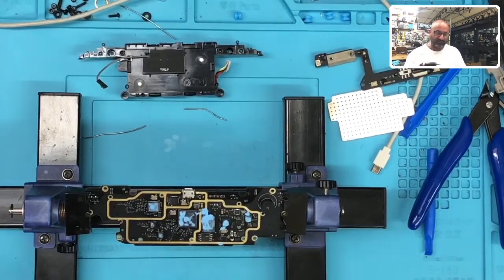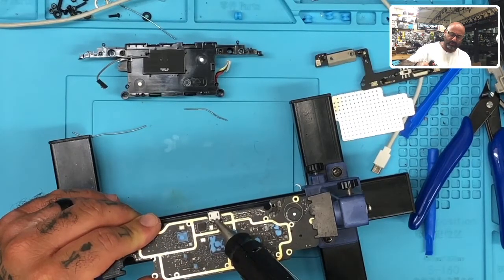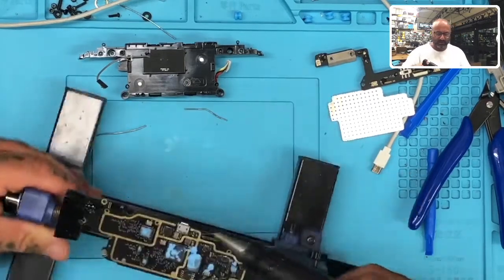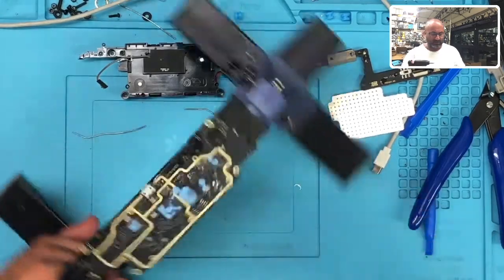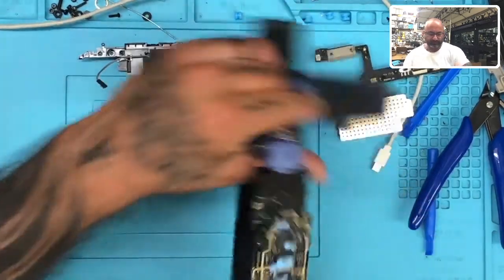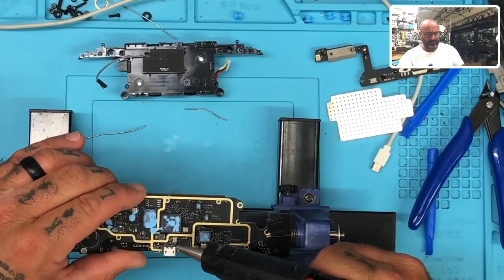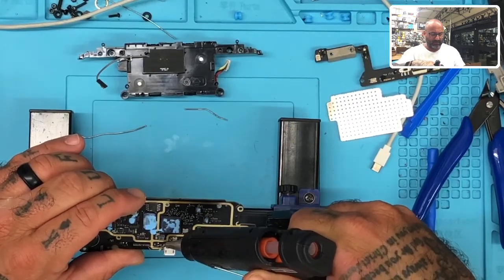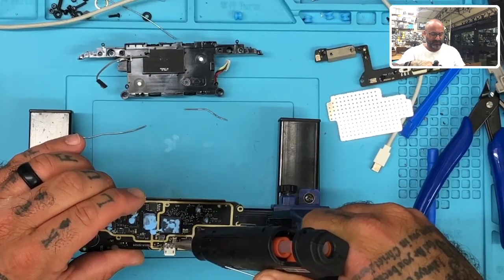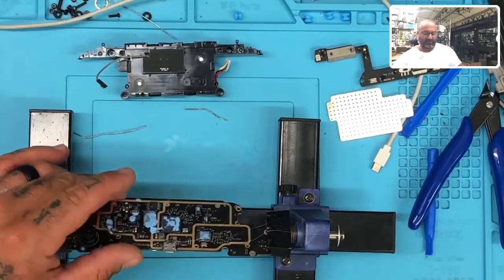All right guys, we're back. The glue gun looks like it's heated up well. So I'm going to come in and drop some glue right on the solder point — on the pad that we soldered. I'm going to come around the side here and put some more right here on this side, and put some more on this side right here. Basically just try to reinforce this a little bit, but the main area is going to be on the back where we have the pads soldered.